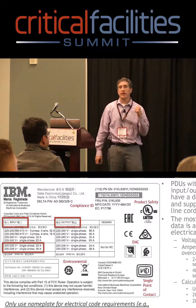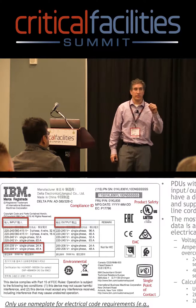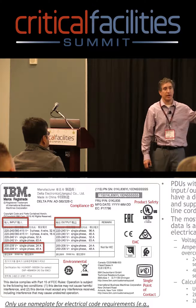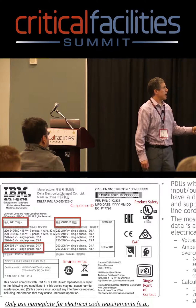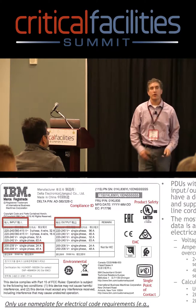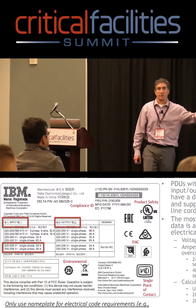The first thing that'll tell you: if you take the 24 amps and use the electrical code — what's in there talks about multiplying by 125% to get the service — 24 amps will be a 30-amp service, and 48 will be a 60-amp service. So from the nameplate, you know the type of service you have to supply to the PDU.